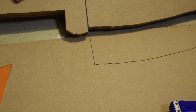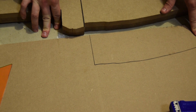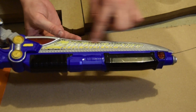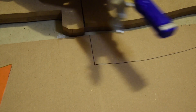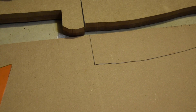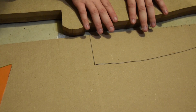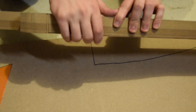Next up, I've already traced out the shape of the blade that is going to encompass the detailing on the sword itself. This shape is going to overlay here — I'm going to cut out the middle section, there's some line detail, and this entire eyepiece. Next step is drawing it out, taking it to the bandsaw to cut that piece out, then to the scroll saw to cut out the middle section, flipping it and cutting that out again. Hopefully by end of night I can glue the two ends to the main body and work off this next time.